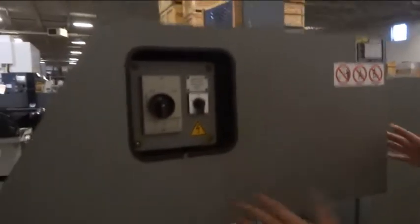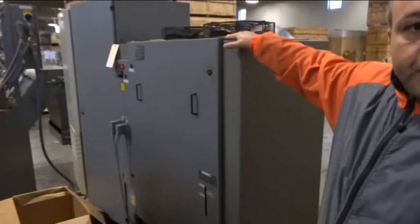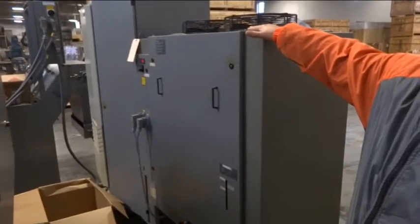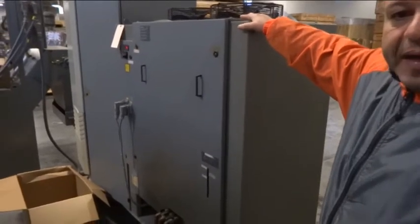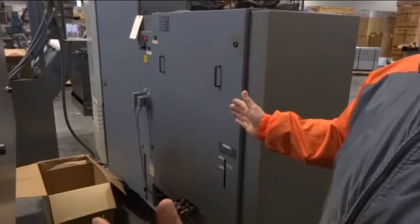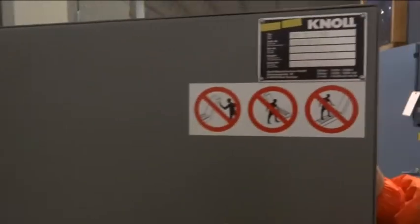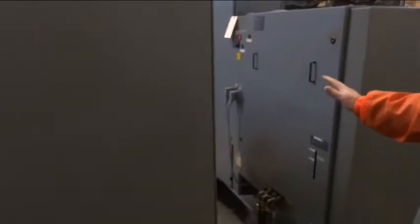So you put the chip conveyor inside the machine when you have the machine leveled, guys, okay? You can place this tank here. This is the chiller for the spindle and the chiller for the torque table. And you can place that. We have the diagram, York sends you the diagram too. You can put that a little bit closer even to here. Only make sure if you need to service something, you can take this easy out. You can open the door for chiller units, etc., to service for your chip panel here.